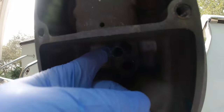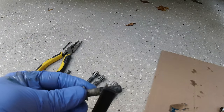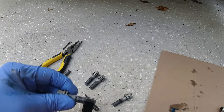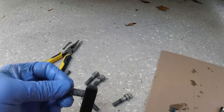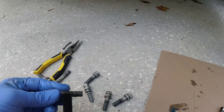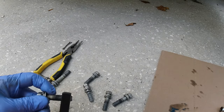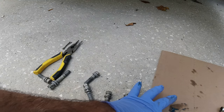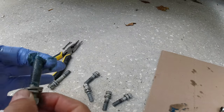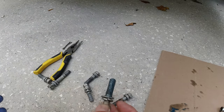Put the grease around the little tube there. Right before installing the out drive — these bolts have a lot of anti-seize, we don't want to put those bolts back in like that. I noticed the anti-seize worked very good, but on this bolt here the anti-seize — it looks like this bolt gets very wet all the time. This time I'm not going to use anti-seize even though it worked on all the other bolts. I'm going to use some grease instead. Once a bolt gets wet a lot, it's important to lubricate it with grease instead of anti-seize. Just grease up that bolt really good so the salt water doesn't get in there. This bolt is ready to be assembled — I'm going to do that to all the bolts.